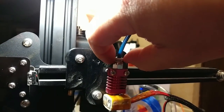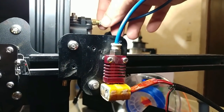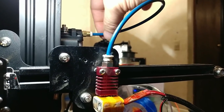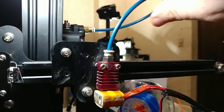One of the first things I'm going to print is some clips. They make little clips you can stick in here so that the fitting does not come undone. This one doesn't like to stay up, and if it pops down the tube can pop out during retraction. So a little clip goes here and a little clip goes there to keep these from coming loose.